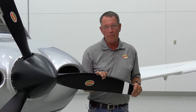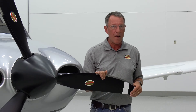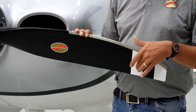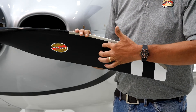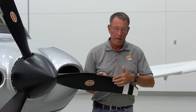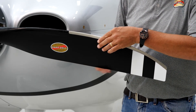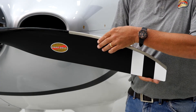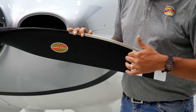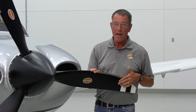The first inspection to perform is a visual inspection of the blades. You'll want to check the blades for nicks, gouges, loose material, erosion, cracks, debonds, or delaminations. Nicks and gouges that penetrate the composite material need to be evaluated. Damage in the paint itself is not an issue. Loose material often appears on the trailing edge of the blade, generally due to an impact. You'll want to inspect the trailing edge especially for loose material, although it could appear elsewhere. Also examine both the face and camber side of the blade for cracks, debonds, or delaminations.